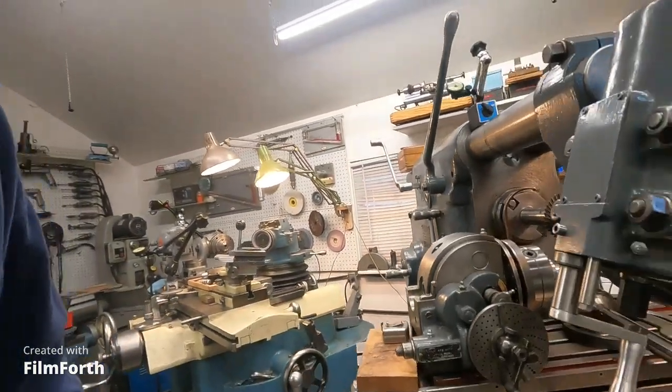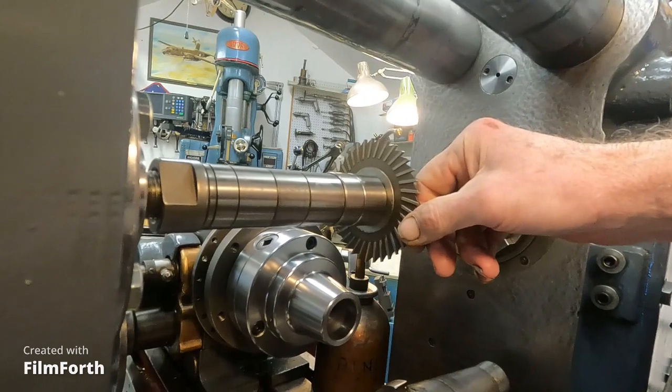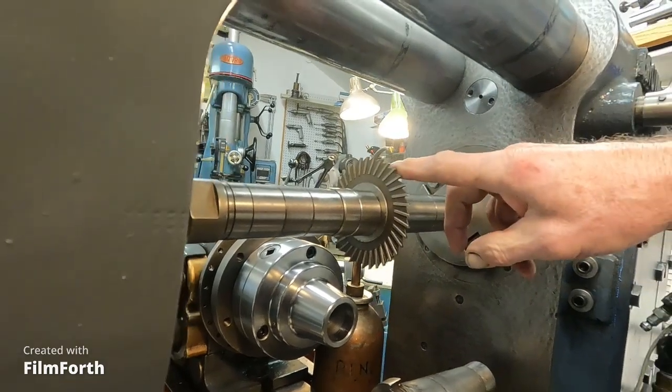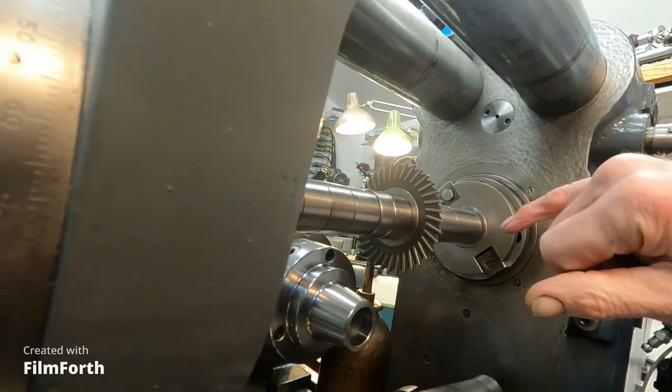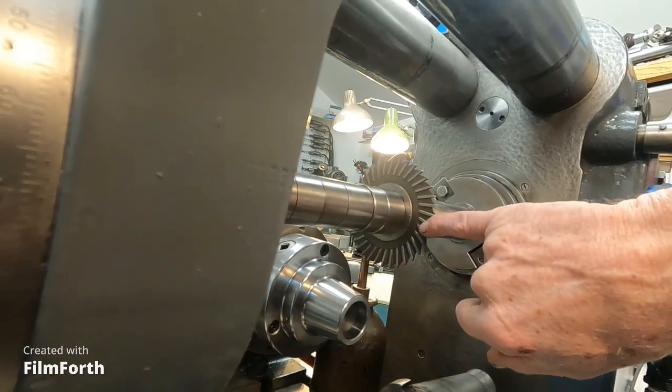I'm going to pick up some slab cutters and use them for roughing stuff out, and a few extra wheel cutters. Then you can more economically do a lot of simple things like slotting and stuff like that, because you can easily resharpen the cutters. The wheel cutters have a lot of teeth on them — like this one, this is just an eighth-inch one here. They last a considerable amount of time before sharpening, and you can keep gnashing it back and sharpen it until there's nothing left of it.